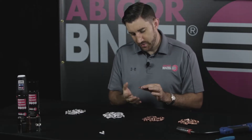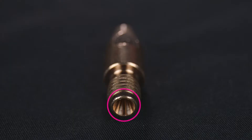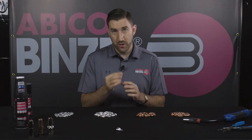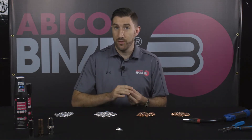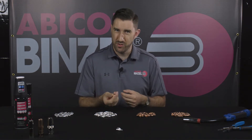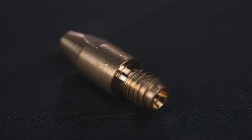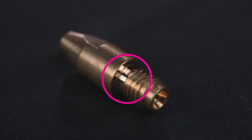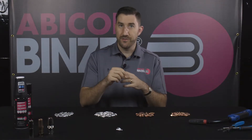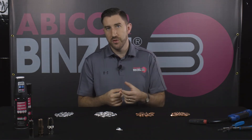Aside from the tapered front end for cleaning access, you're also going to see on the threaded area where the wire entry is, the shallow entry on the bore. The shallow entry kind of looks like a funnel up close, and that's certainly by design to help the wire feed into the tip without bird-nesting at a pretty crucial point in the torch. There's also the chamfer base, designed so that the contact tip will sit nice and snug up against your diffuser.